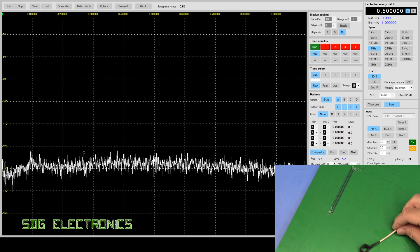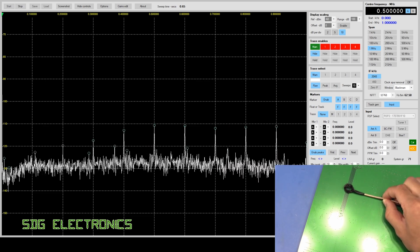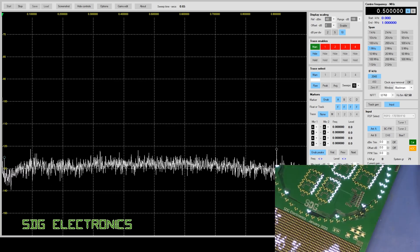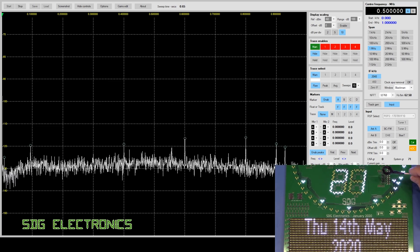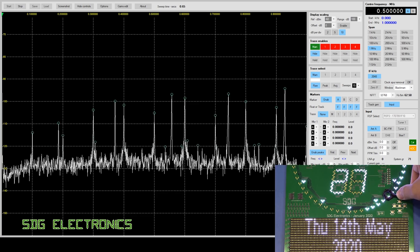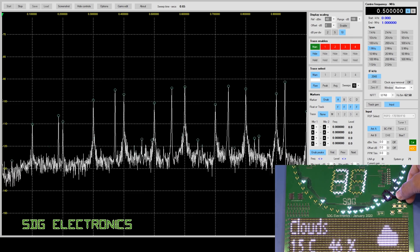The rest of the PCB is generally shielded by a ground plane, so we're picking up a bit of noise on these traces here which go to the anode drivers for the LEDs, but everything is sandwiched between a ground plane on the top and bottom layer. So the overall noise is not too bad — it's just from specific components. If we hover directly over the LEDs you can obviously see some noise.